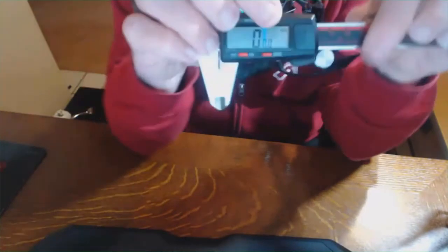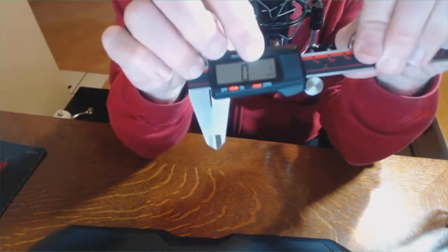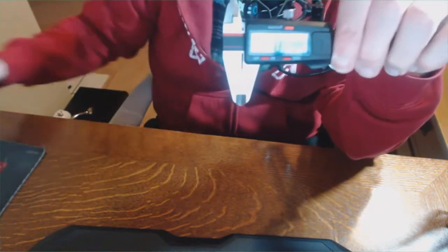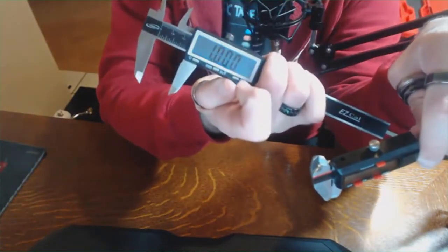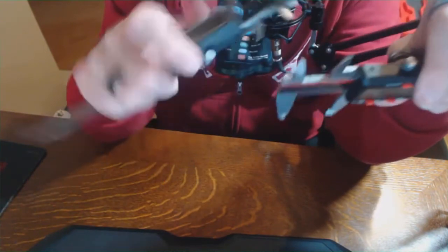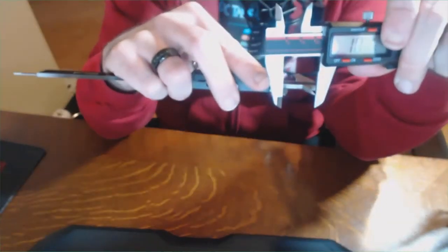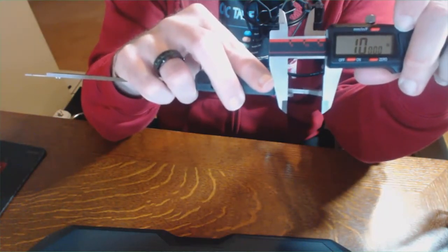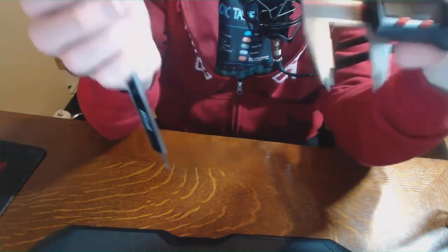It has all the standard features. You can select the units: inches, fractional inches, and millimeters. Let's compare the readings on this one to my more trusted caliper. It's locked in at one inch, so let's use the internal measurement of this caliper to measure the external side of the one-inch reference. They match pretty well — precisely one inch. So one inch on this caliper is one inch on the reference. That's actually better than I would have expected, with no apparent machining error.